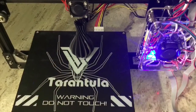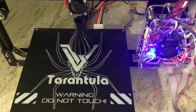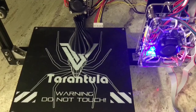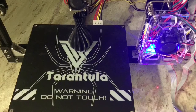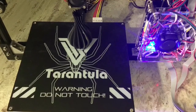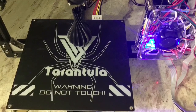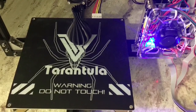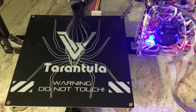After that, you're ready to go ahead and test your printer. You can generate some G-code, put it on the SD card, and then print. See how everything goes. If any of the motors go backwards, like the Titan extruder motor will most likely go backwards, you can change that in your firmware and upload the firmware again, or you can unplug your power, reverse the connection of the wires in the motor connector, then plug the motor back in and plug your power back in.